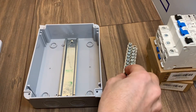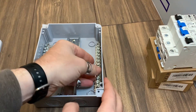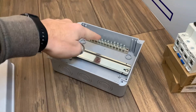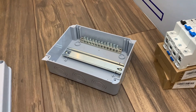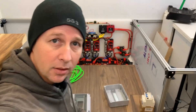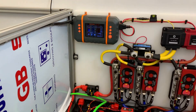To start with, I need to install the ground and neutral buses. These are simply going to get mounted on each side of the box, but that brings up one issue. Because they're mounted on each side, it means I can't use any of the side entrance knockouts on the box, which means I'll have to do everything in the bottom and top. That is going to be a little tight over here as we have a breaker underneath and a charger above, but it does fit.